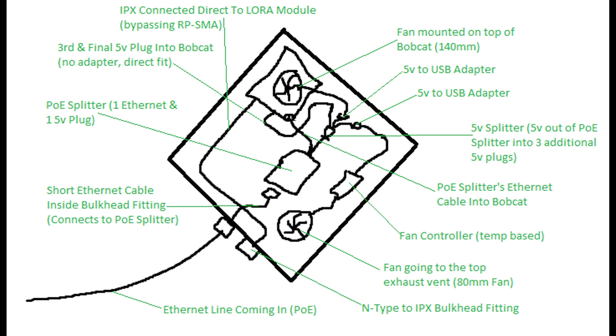When you go inside the box, that's going to be a bulkhead fitting that gives you the watertight connection for the ethernet line, and once you come inside, that will plug into your POE splitter. The POE splitter on the other side has one short ethernet cable and one 5V female connection. We need more connections than just the one 5V because the Bobcat itself needs 5V as well. So you take a 5V splitter with a male end going into the POE splitter, and it will have three female 5V connections. You can split two or three — in my case I'm running two separate fans inside the Bobcat, powered differently.